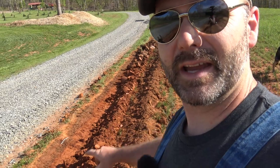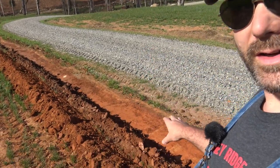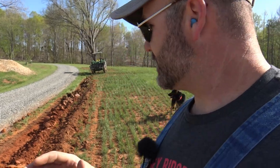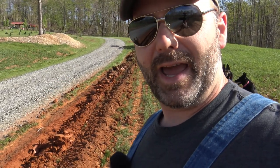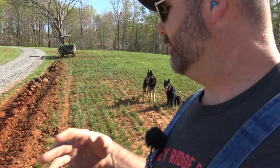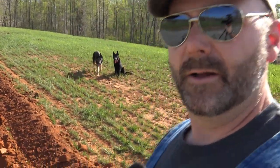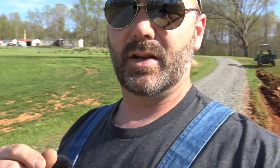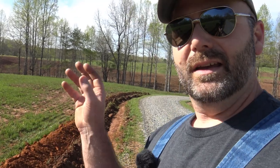Now we've cut up to the edge of the driveway and it's a little bit more manageable — it even looks really nice right through there. The next thing we've got to do is deal with this pile of dirt. We'll slightly adjust the blade to pull this smooth and pull this dirt over into here, and hopefully we'll be able to mow it a whole lot easier now. We'll take our seed drill and drill down seed and probably roll out a bale of hay on this area so it doesn't wash right away. I was really concerned about this — when I hired the bulldozer crew they cleaned this whole area off and there was a huge embankment, about five feet tall right here and five or six feet tall right here. We knew we'd have to do a little bit of dress-up work. So this is the dress-up work — pretty fun, I'm enjoying it.